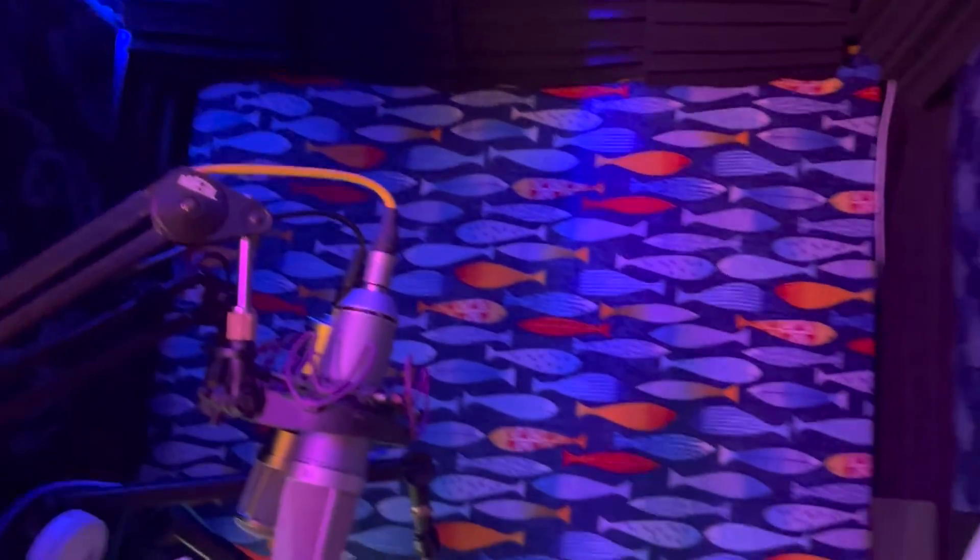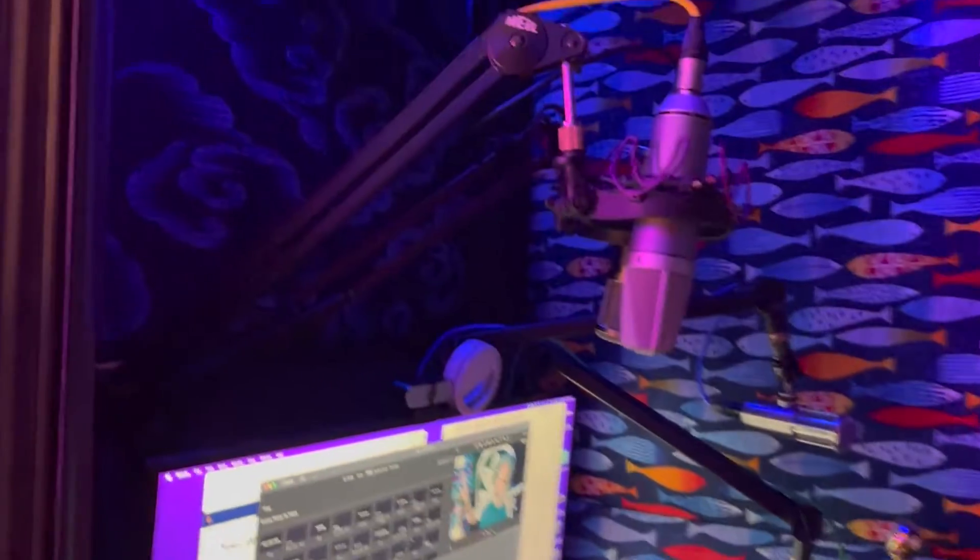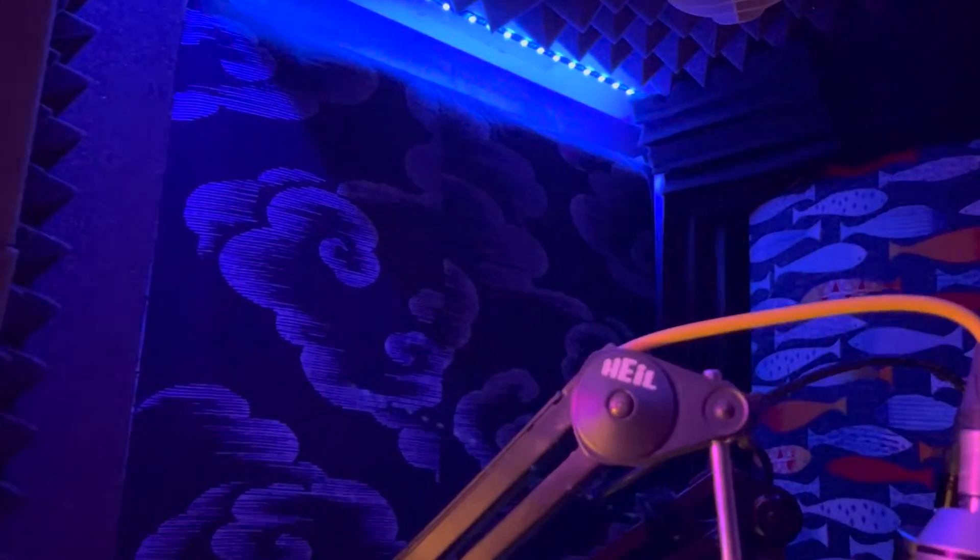Since I had to furnish all of the sound treatment myself, I built these acoustic panels by hand — it's just a wood frame, rockwool insulation, and cloth on the outside. You always want to put kind of a cheesecloth or something in between the outside cloth and the rockwool so it doesn't leach through at any point. They're really easy, simple, and cheap to build and very effective. It really, really helps with controlling the low end.